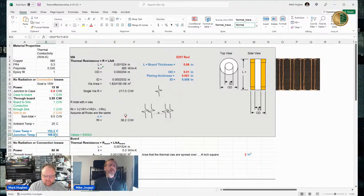Let's change the power down to 10 watts and see what that says. The thing is I'm calculating the case temperature below the chip, and there's a difference. This component — are you familiar with cavity up and cavity down? In this case the cavity is up, meaning the chip is mounted to a substrate by epoxy, and from the chip junction going down through the package, it goes right down toward the board. Some packages are flip-flopped so that configuration goes up to the top of the case.